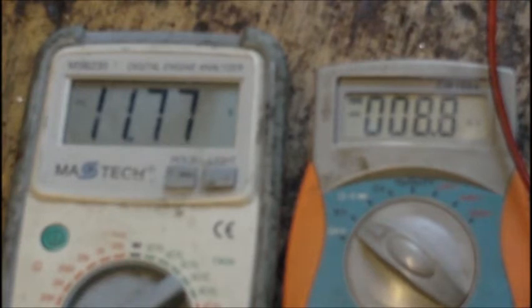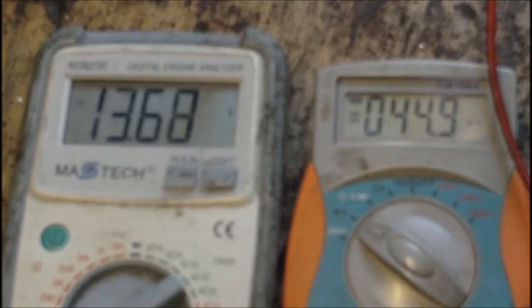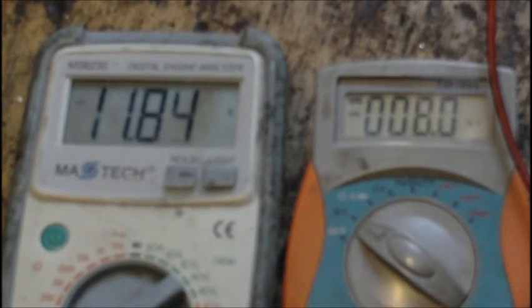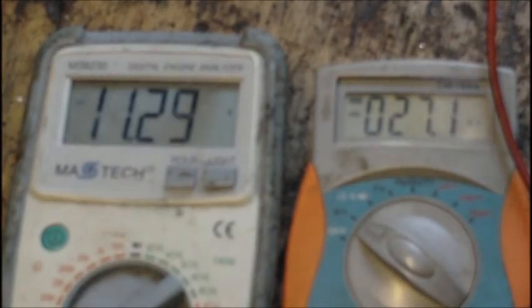Now is that a good thing or a bad thing? That's the next thing we need to figure out. I'm going to try something rather interesting here — I'm going to increase to 40 volts shunt voltage. 40 volts on the shunt field now, and I'm going to drop that straight off. And we're going to throw 40 volts straight back on the shunt — now. Well, I don't know about you guys, but that sounded a lot like regen to me. Let's do it one more time for luck — and 40 volts right on the shunt field — now.